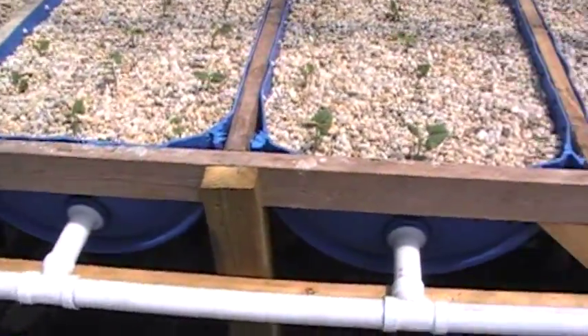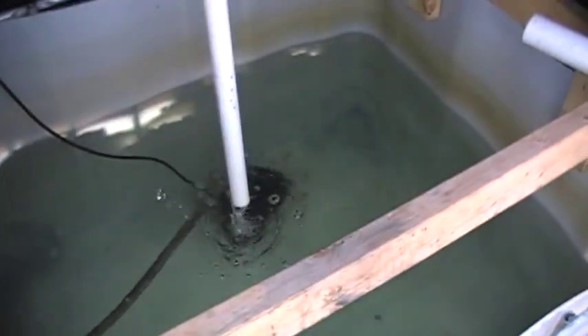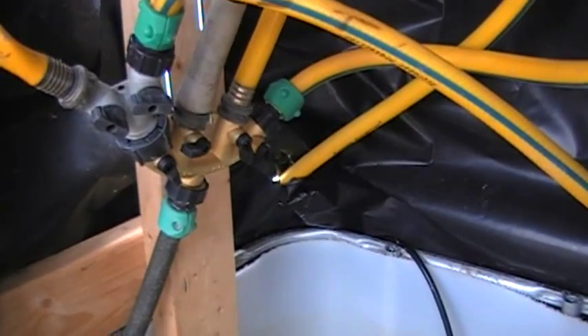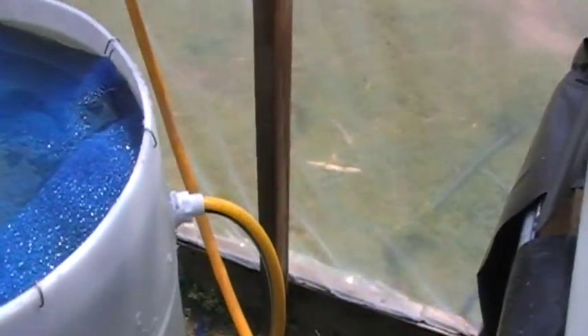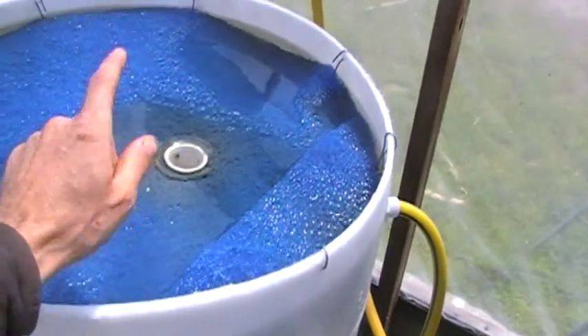All I did was connect each one of these barrels together. I used this idea from another guy on YouTube, so I'm not the first one to do this. What happens is the water comes in — I got a submersible pump down in there — and then it runs up to where I have a whole bunch of valves, and they're all going out to different places. One is running right into here into the barrel, and as the barrel fills it has to come through this piece here, and then everything runs down into this pipe and comes out through the bottom.